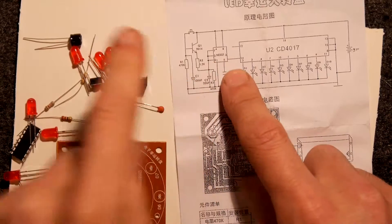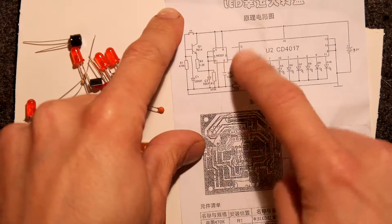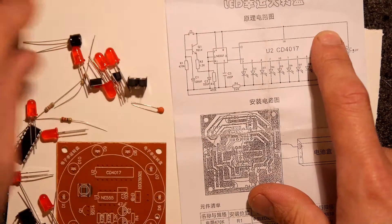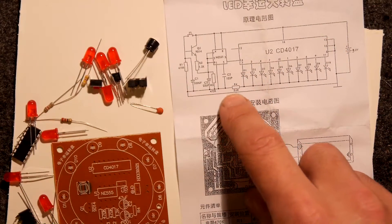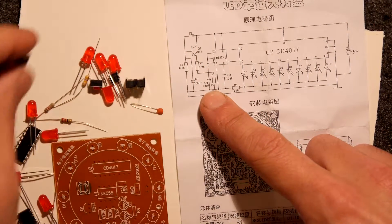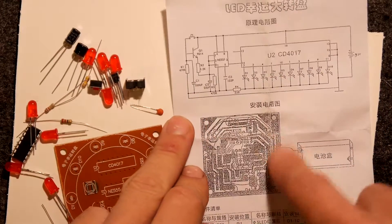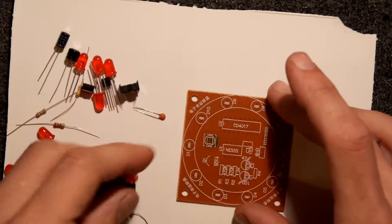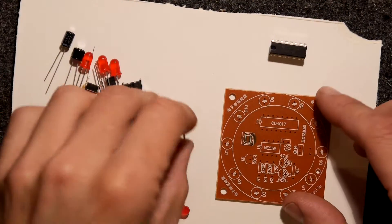So we push the button and it's going to kick off the 555 timer, which will start going. I'm guessing there's probably an electrolytic somewhere - yes, there it is, 22 microfarads. There's another electrolytic right there. Anyway, it's a decade counter - it's going to spin around and then do a relay thing. We're here to learn how to solder. The big IC goes that way and the small IC - the 555 timer - goes there.